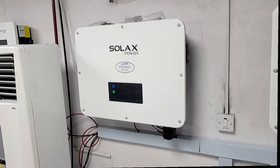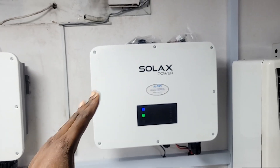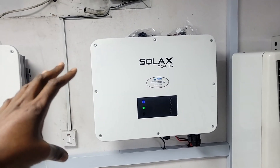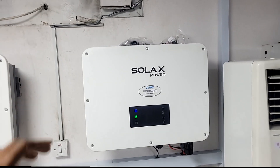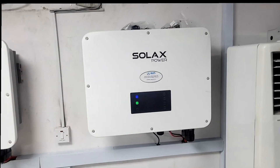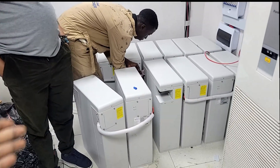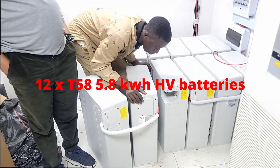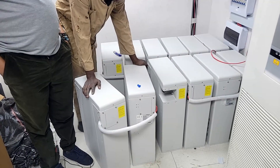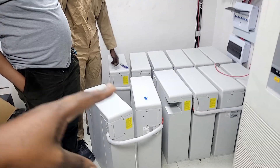It's IP65, which is overkill for this place because this is a server room that will always be closed. We have three independent MPPTs, which is very powerful, and I can do up to 60 kilowatts. This allows me to charge and at the same time power my loads. We're going to run about 360–370 volts on the batteries. That limits what we can charge and discharge, so our PV is definitely overkill relative to our battery voltages.